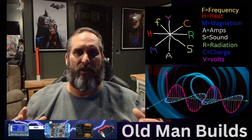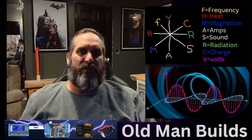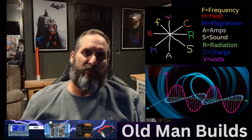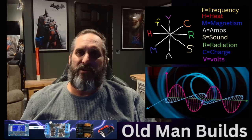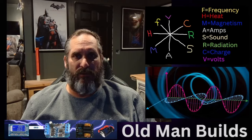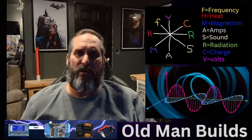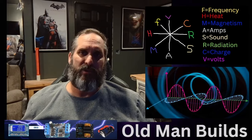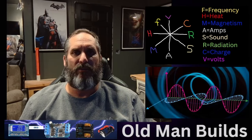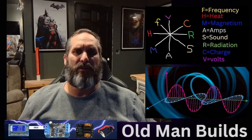We're not running real big here, so you're not going to find that in our little ZVS circuit. But the understanding of volts and amps is going to change for you — no longer are you going to say 'I'll just put this many volts and this many amps and I'm okay.' High voltage is tricky because you can't exactly measure it — you measure the spark gap and that's how many volts you think it is. Can you measure the frequency? You can take your oscilloscope probe and get the frequency, but it's very distorted if you're not at a distance. There are certain frequencies you don't want to be in — 50 to 60 hertz, don't put it near your TV, it's going to ruin your electronics. Get it up to the kilohertz and you'll start hearing the sound difference itself.